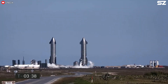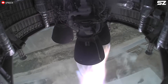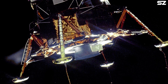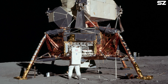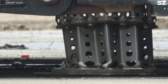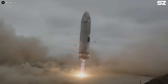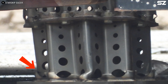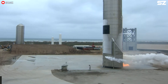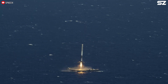To be fair, Starship initially featured landing legs. In fact, SN15 was the first Starship prototype to successfully complete a flight and land safely with the use of these legs. The initial landing leg prototypes were built using a crush core design, inspired by the Apollo lander's landing leg structure. This design features progressively larger holes drilled down the length of the leg, with more metal concentrated toward the top. The crumple zone starts at the base of the legs, absorbing impact as the force increases, requiring more energy to crumple further up. While the legs often sustained damage and deformation after each test, this was expected. SN15 demonstrated that with continued development, SpaceX could eventually perfect the technology and successfully land Starship on its legs, just like what they do with their Falcon 9 rocket.